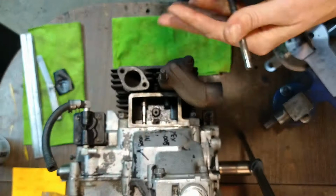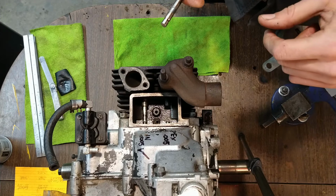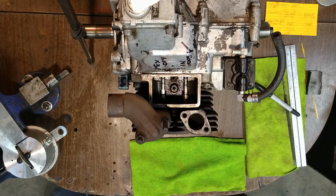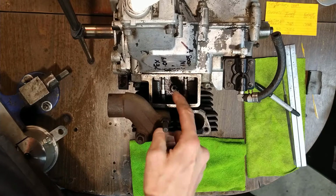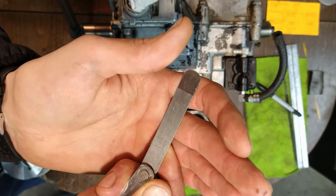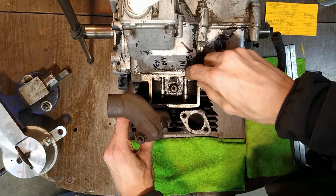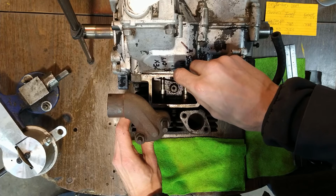Okay, we are going to sand this down some more, get it nice and smooth, take it over to the wire wheel, put it in, and check it again. And then we'll be back. All right. Let's take a look at what we've got here. I've taken this off and cleaned it on a wire wheel, and now I've set it back into the guide and checked it again for its final measurement, and this is a 12 to 14 gauge here. Yeah, 12 to 14. And 12 goes through, 14 grabs a little. Rotate the valve, 12 goes through, 14 grabs just a little.